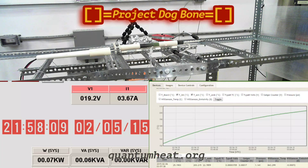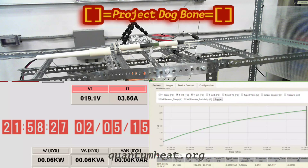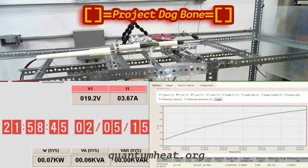So I want to put 20 millibars of hydrogen in there, pump it down, and put a little hydrogen in. And I've got nickel electrodes made, spark plug pass-throughs. All that stuff's ready to go. I just need to machine the conflat end plates and bolt it together, and it'll make a nice show on the internet. And then I can send samples of the nickel foam and have Ryan look at them in the electron microscope.